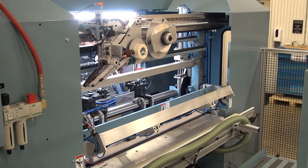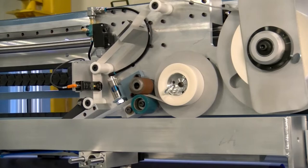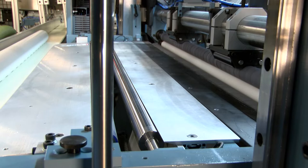There are two methods to automatically seal the finished rolls in the seal station. The included automatic glue system applies a programmed amount of cold-set glue to the tails of the finished rolls during the tail cut sequence. As an option, the automatic tabbing system can be added or replace the glue system, which applies a pressure-sensitive sealing tab to the tail of each finished roll.